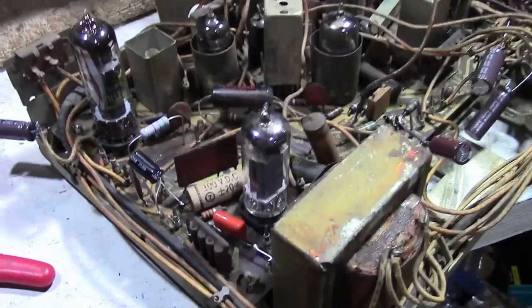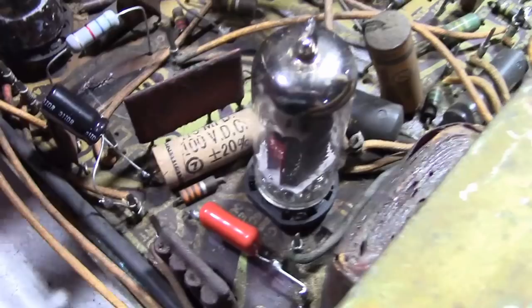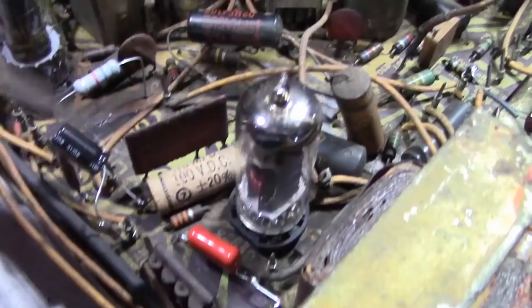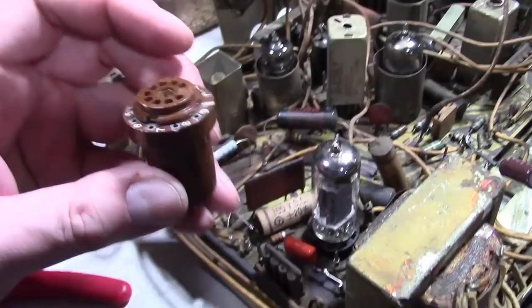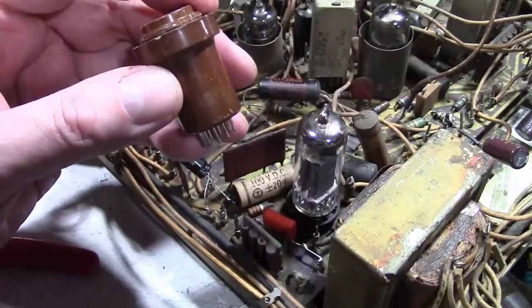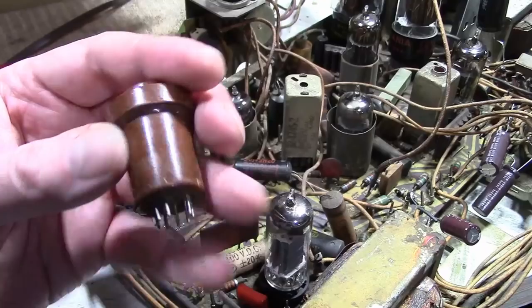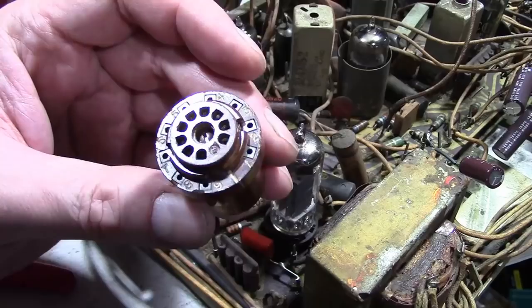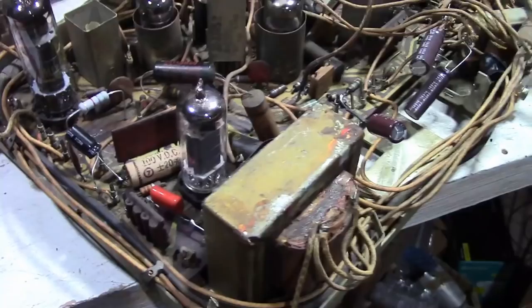I can also do some troubleshooting. The tube pins aren't easily accessible but you can trace where they go - they conveniently replicate the circuit board traces with silk screening on top, so these yellow pathways correspond to the copper down below. I also have a set of socket extenders made by Vector - these are worth their weight in gold and not easy to come by. You take the tube out, stick it in the extender, put the extender in the socket, and you get all these very readily accessible test points. I've got three 7-pin, one 9-pin, and an octal. This is a 9-pin tube so I can pop this out and stick it in here - at the very least we can see if the vertical oscillator is even running.